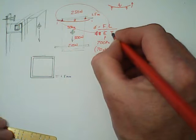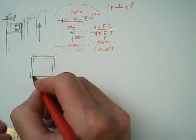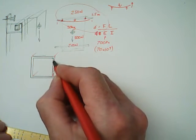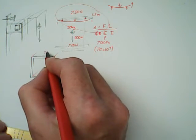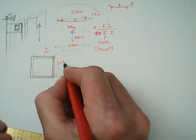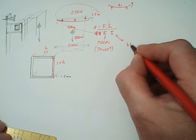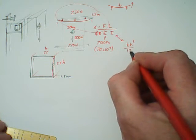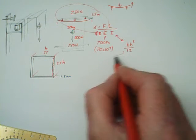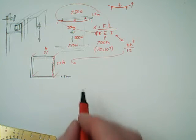We can justify this. It's going to be the Young's modulus for aluminium, which is 70 GPa. Check that. I think sometimes it can be seen 69. We're effectively going to use that. Okay, it's 70 times 10 to the 9. That's going to go in there. And then we're going to use I, which is the second moment of inertia. So for this particular piece, this beam, if you will, this cross-sectional area that we're talking about, it's 25 by 25.